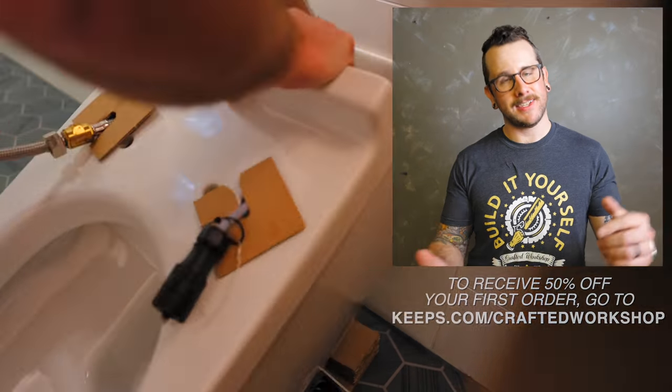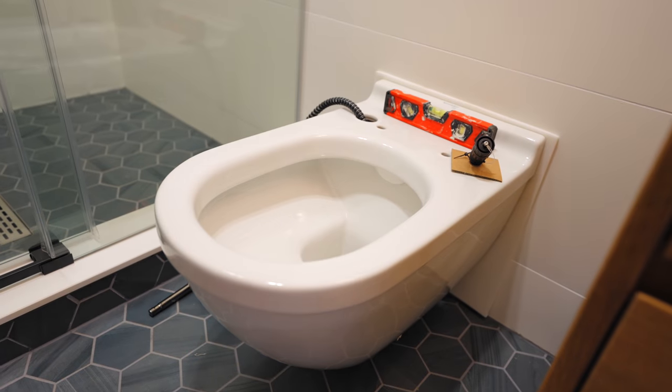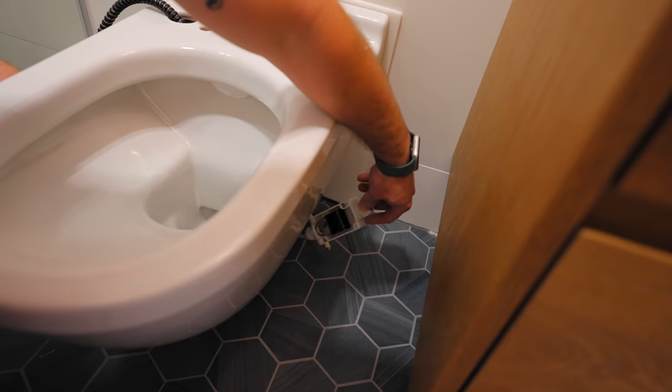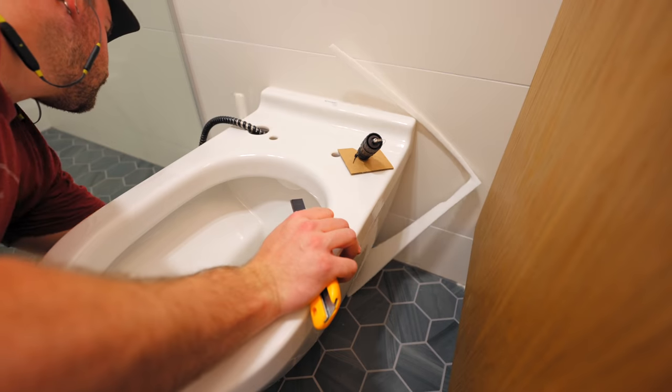I struggled with this toilet for about half an hour, thinking I was doing something wrong, when in reality I just hadn't cut the pipes quite short enough so the toilet wouldn't sit flush against the wall. This toilet weighs almost 70 pounds, and I was completely shot after wrestling with it for 30 minutes. Finally, after I took a step back and let my rage subside, I figured out the problem — after trimming about another quarter inch off the pipes, I got the toilet mounted successfully. Once done, I got the electrical box wired, which is hidden under the toilet — just a simple connection of the hot, neutral, and ground. I also got a noise reduction gasket trimmed flush with the toilet to avoid having ceramic against ceramic, which I felt could cause issues over time.